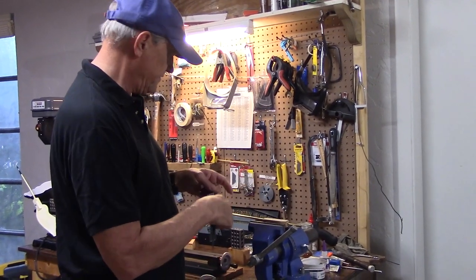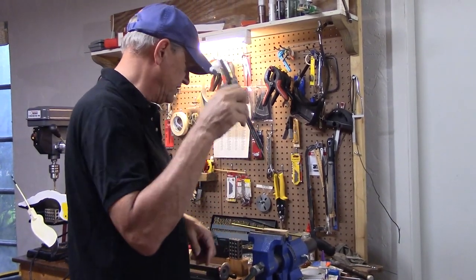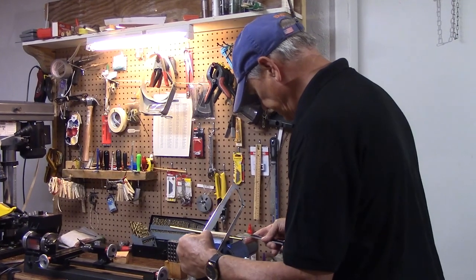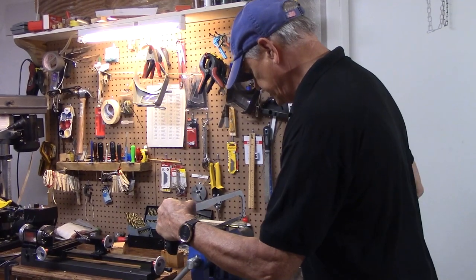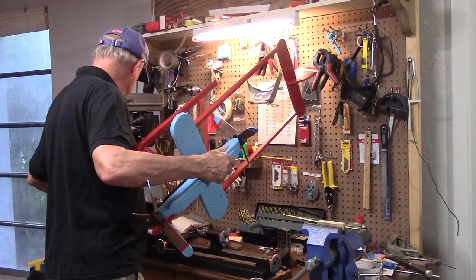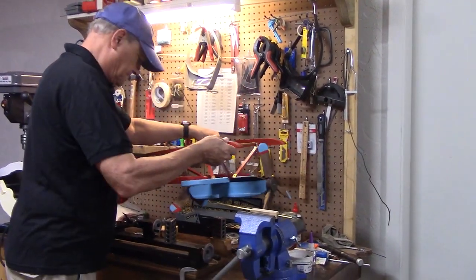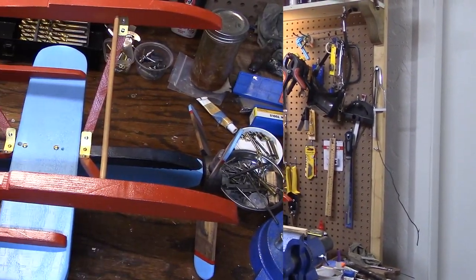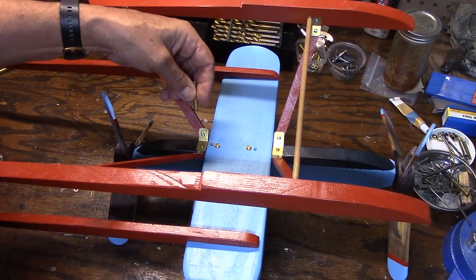The end of the calipers has a pin that sticks out for measuring into holes, so I just hold my saw against it and start the cut at an inch and a half. I've already cut that out. Now with the airplane up and the hole ready, before I put the pivot bearing in, I've got the seaplane body upside down on the workbench propped up with the 1-2-3 blocks.